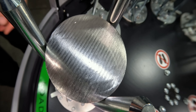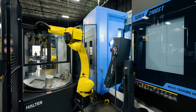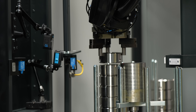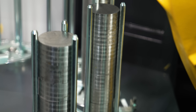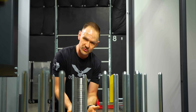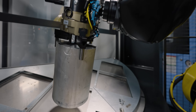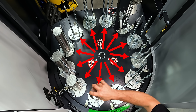This machine setup is known as a turn stacker — a little different than what you'll see on Tyson's SMX. It's designed for parts that can stack on top of each other. Another thing this system is really designed for is parts that aren't very tall, so you can stack a lot of parts based on height. If you had a part that was four or five inches tall, you'd want to go to the universal, which has a grid pattern layout for parts that don't stack or are very tall.